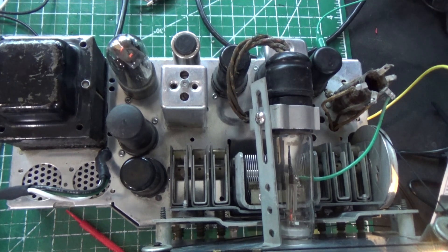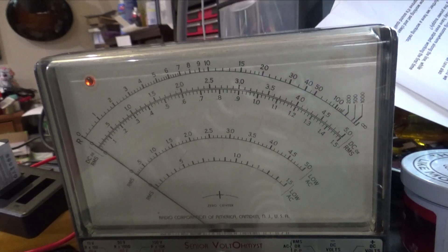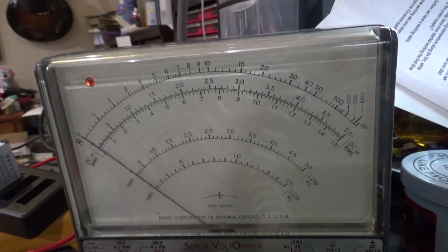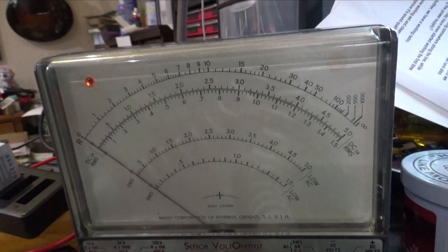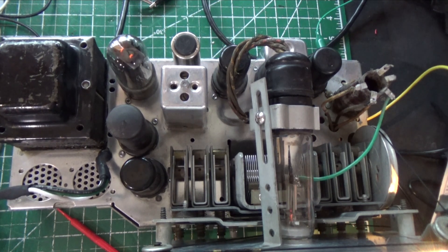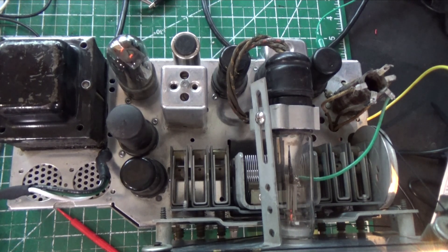To do the high bands, they want you to put a 200 mmf capacitor in line with the antenna connection from the signal generator. I have a 501K, which is 0.0005 microfarads, in there. They also want us to tune the signal generator to 1500 kilocycles. I've already done a calibration on the oscilloscope, and they want us to turn the dial to the 1500 mark.